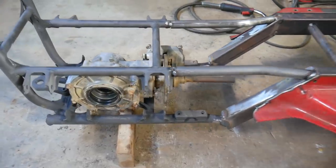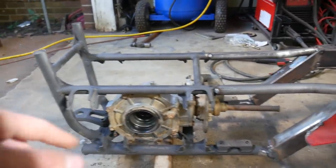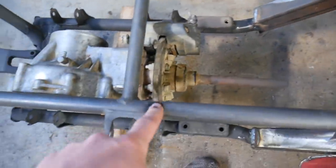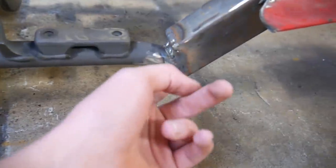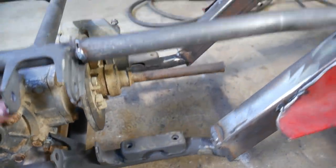So guys, I really love how this turned out, and of course the lawnmower body will still fit over this and we'll still be gusseting the crap out of it right here, and then like right here we'll be gusseting all that and probably throwing some more supports just because a butt weld like this isn't really that strong. So yeah, we're just gonna gusset everything.